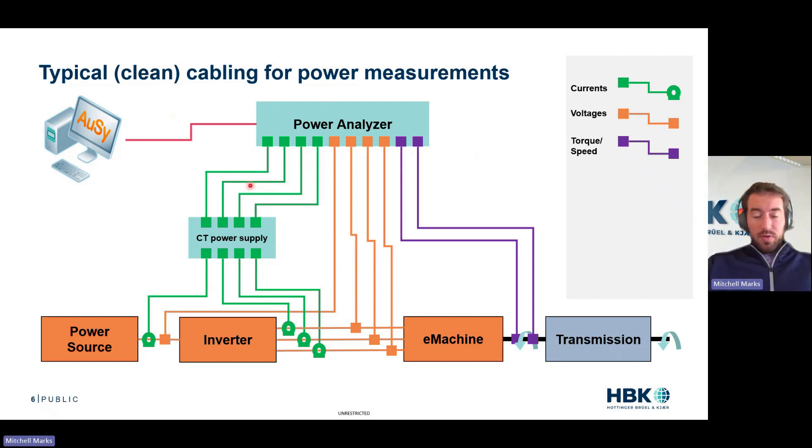In some setups this might go to multiple instruments. But we've got eight cables for current, another four for voltage, and these are carrying high voltage all the way from the measurement to the instrument. Then we have some sort of measurement — whether it's a frequency, whether it's an analog coming back from torque and speed — and potentially another torque and speed after the gearbox. This is then coming back to some sort of automation system. These are typically all copper connections, all cables, all safety hazards, and noise sources — EMC, antennas — and there are a lot of cables.